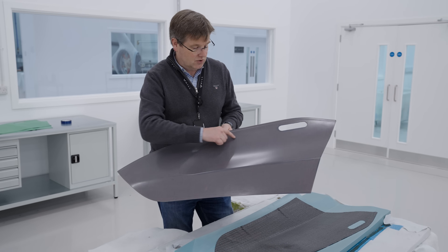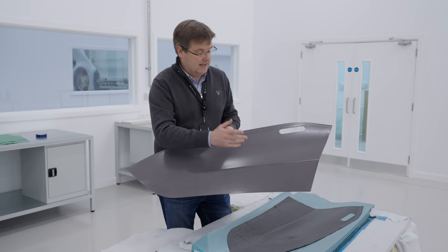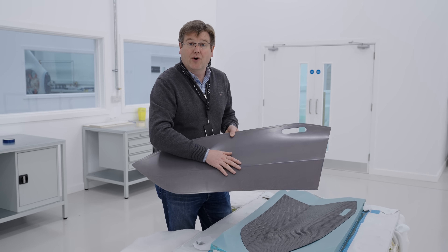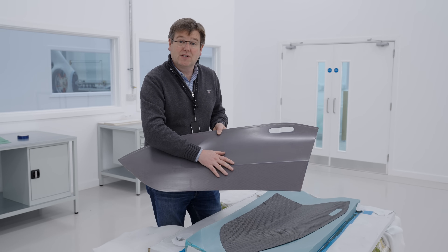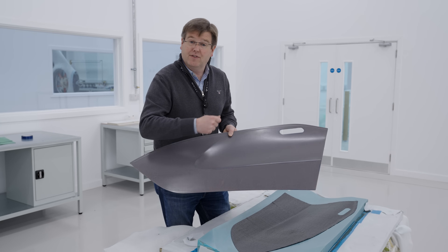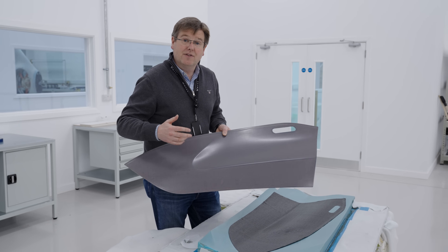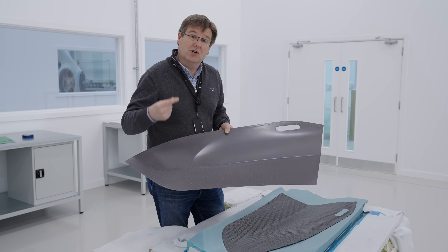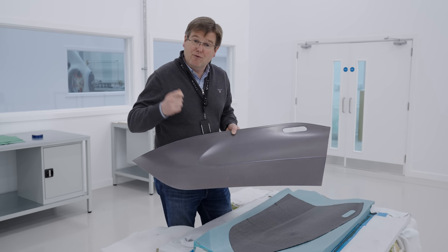You don't actually need this for doors, but we've used this as a demo panel — the carbon fiber, the copper lightning strike mesh, and then over the top we've got our primer pre-coat layer. This means that when these panels come out of the curing process they're essentially ready for a light sand and then to have the final paint finish applied directly. These are precisely the methods we're using across the whole fuselage to make production of the HX50 fuselage faster and more efficient than ever before.